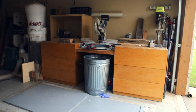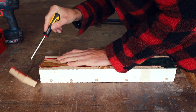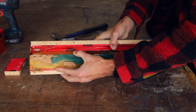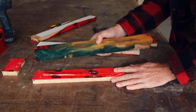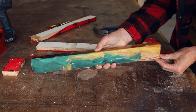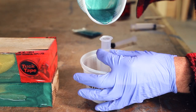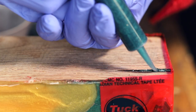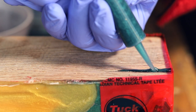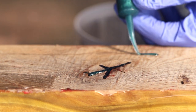So close. The following day, I pulled the board for the handle out of the form. The beam had a few voids on the side I had to address. For this I used a syringe to push the epoxy down into the crack. This works great for those smaller voids, but it wouldn't be very efficient for the larger fills.